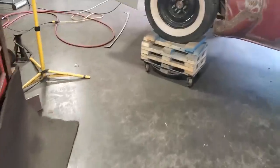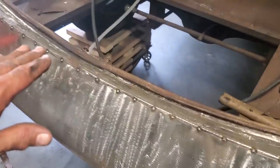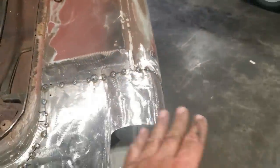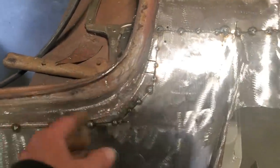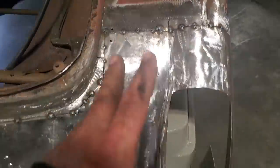So, you know, if you try to do this panel that way, you've got a lot of work ahead of you, okay? Fellas talk about how it's better to cut it, trim it, and fit it, and all that type of stuff. The problem you've got is you have to come over this way, and then you have to work your way up. Now, the panel turns this way, and then it kind of flows up and goes over. So you've got to get all this flow right. And it's very hard to work when all this here is alive, okay? So when you're starting here, I got all this straightened away, so all that's done. So all I had to work with is making this section fit. And I worked from here on the way out because I got this section gone. So I can work on that.